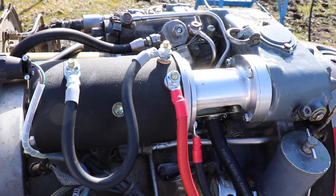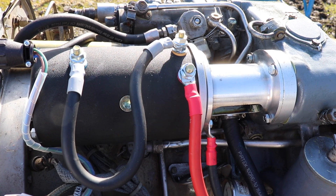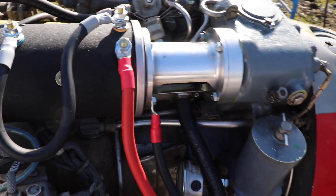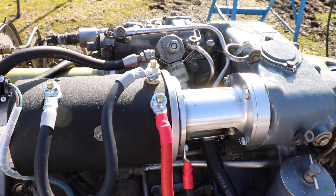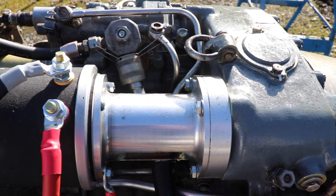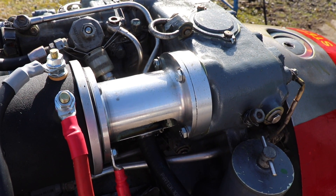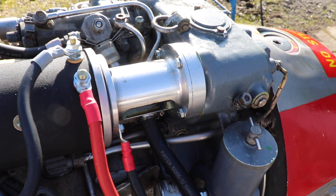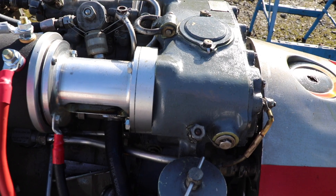What we've done here is use a very large winch motor, and the beauty of these things is that they're reversible and certainly meaty enough to spool the engine up to a suitable speed for lighting it up. Being reversible, you can use one of these on just about any engine, providing you're prepared to do the machining needed to adapt the starter motor into the gearbox, which is what we've done here. I must give acknowledgement to my friend Andrew Phillips from Cross Engineering, who has done a fantastic job — highly recommend them if you're interested in sorting out a starter motor problem with a gas turbine engine.